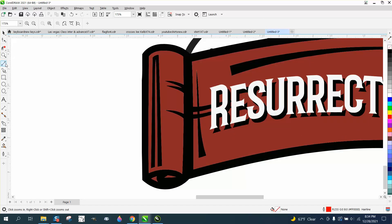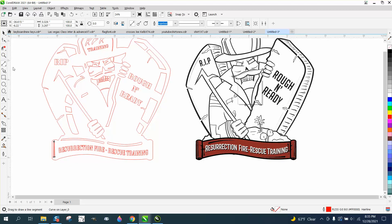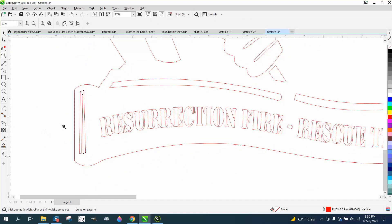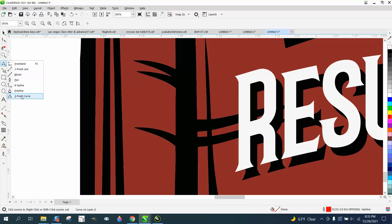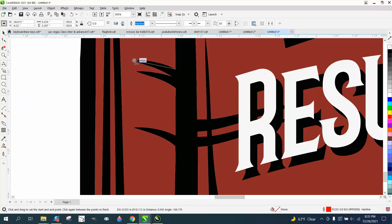Get the two-point line and just redraw this graphic. All I'm doing is holding down the mouse, letting the mouse go, clicking it. That's a pretty sharp point for a plasma cutter but it might work. Now we can nudge that over — now it's on our new graphic, about in the exact same spot. I'd then do some of the other graphics using the three-point line to make curve lines. The three-point curve line is a little trickier because you have to double-click on it to stop it, so it knows you're setting it, but we will get a little curve to it.